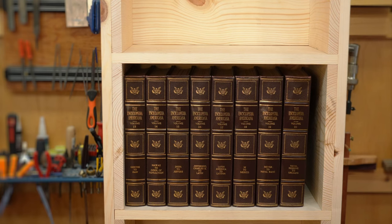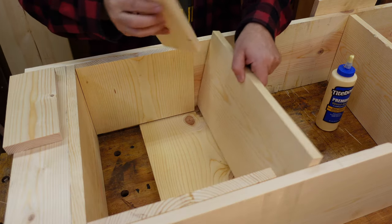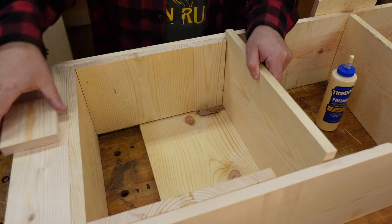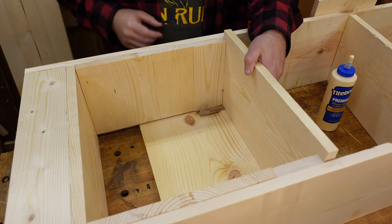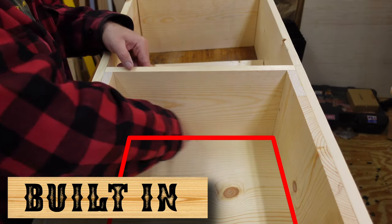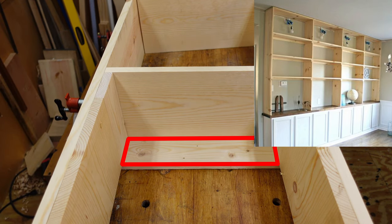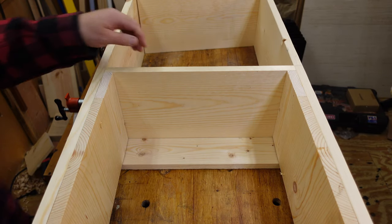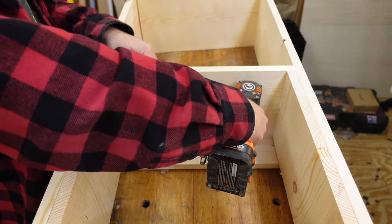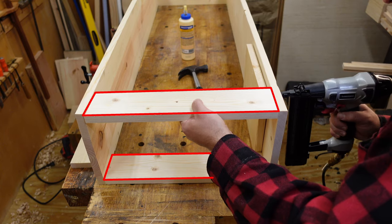Now you have a functional shelf; however, there are a few ways we can tweak this to make it look nicer and add functionality. If a 1x12 does not give you enough shelf height, you can simply stack spacers to gain additional height. Here, I've added a 1x4 so I can fit one-gallon jugs on the bottom shelf. For this freestanding shelf, I've used 2x12s for the back to give it a solid back. However, if you want to do a built-in style of shelf, you can simply use a 1x2 or 1x4 furring strip in the back and then affix that to your wall. By adding a pair of 1x4s under the bottom shelf, you've created a toe kick to keep dust and whatnot off the bottom shelf.